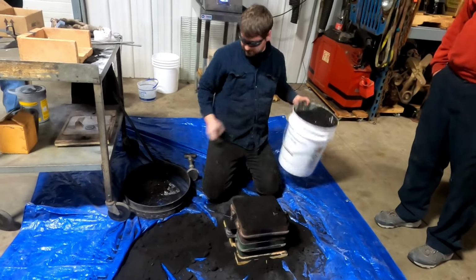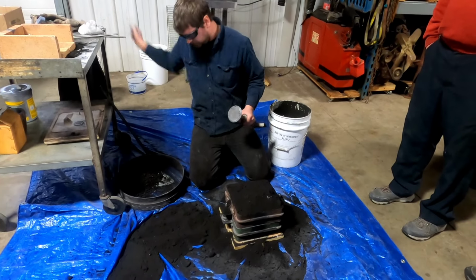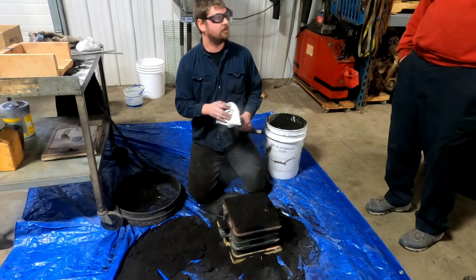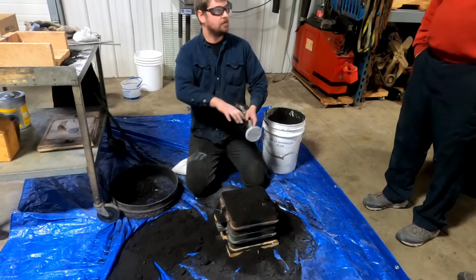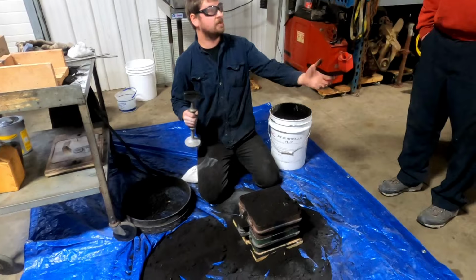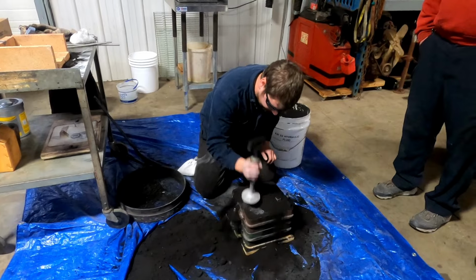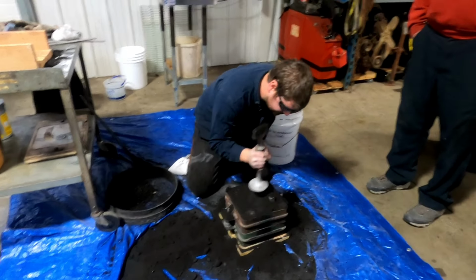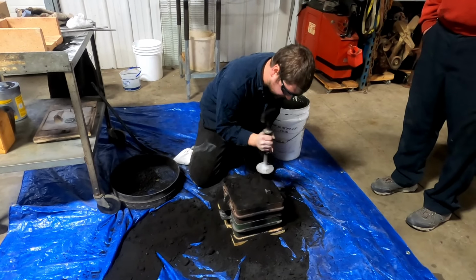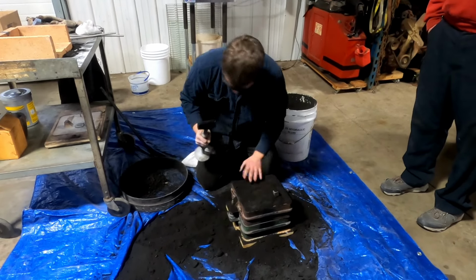The easy method that a lot of people go to now, which isn't as cost effective, is called ChemBond, which is chemically bonded sand. It's sand and glue. You mix it up in a cement mixer or a KitchenAid or a continuous mixer, and when you ram it, you just literally pour it in, pack it, let it set up, and pull it apart. The problem is you can't reuse it. This sand, I can just scoop all this up and remold again. So this takes more skill to work with. I use ChemBond for cores, which is where you need it because this sand doesn't have the strength to make the core. Look like the definition of experience.